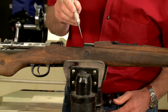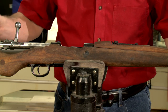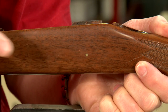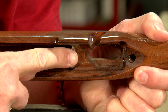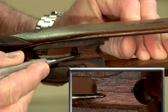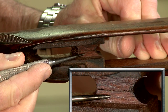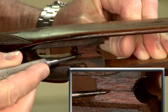You'll see this reinforcement on many World War I and II military rifles such as this Mauser 98, and Remington has traditionally installed a small threaded rod in front of the trigger cut on their stocks. When the energy gets up to 375 H&H levels of 4,000 foot pounds or more, it's generally a requirement to reinforce these areas to prevent them from splitting under recoil, such as on this unreinforced pre-64 Winchester Model 70.